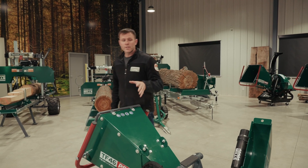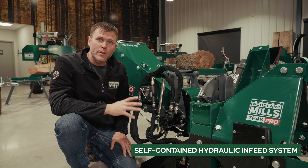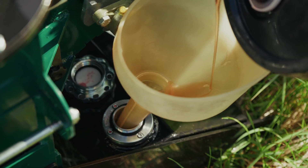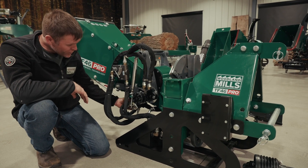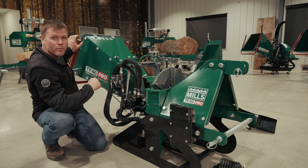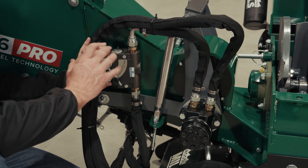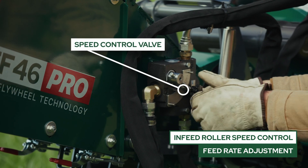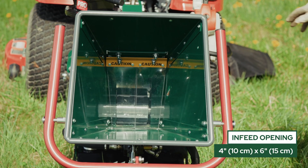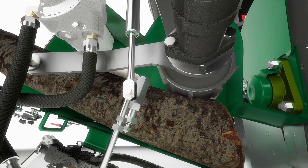The TF46 Pro uses a fully self-contained hydraulic infeed system that doesn't require any connections to your tractor other than the original PTO shaft. The system starts with a 12-liter hydraulic reservoir tank. From there, the hydraulic pump picks up that fluid and starts to create the pressure. That pressure comes into our directional control valve giving us a forward, neutral, and reverse action, which is actuated with the red bar at the back of the infeed chute. We also have a speed control valve to help balance the tractor's horsepower with the material we're feeding in. A hydraulic motor is connected to a six-inch diameter infeed roller with chisel knife-edge blades welded to it, and that roller is going to climb up over the material and bring it into the chipper to present it to the primary flywheel.